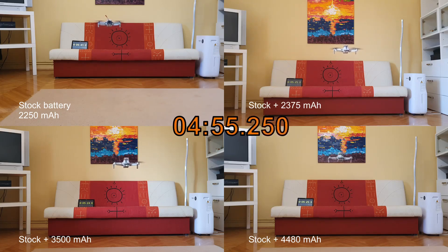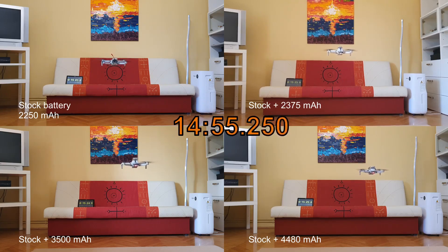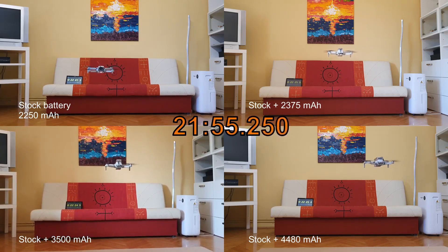I want to talk about the balance charger because this is super important. When you charge these cells connected to the original battery and put it in the drone, it will charge to about 8.7–8.75 volts and cut there. The additional cell won't reach full saturation because of the wire connection, so your flight times will be worse than what you see in this test. What I did was charge the factory battery in the drone separately, and charge the additional cells with my balance charger — which only goes to 8.4 volts — then top them up with an additional power supply to 8.8 volts, letting them charge to full saturation until the charge current drops to around 50–100 mA. This is how I got these results.